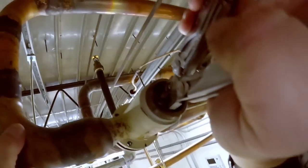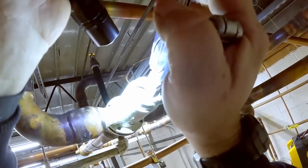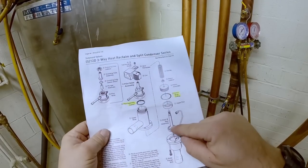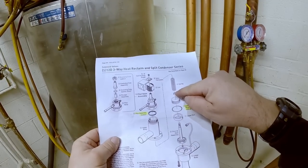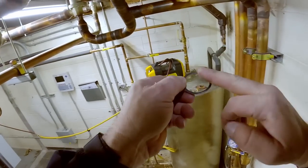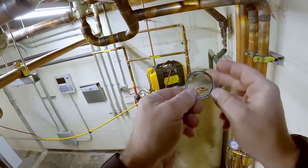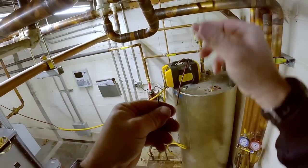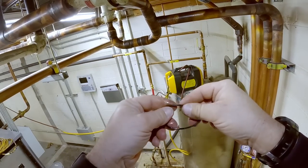There we go — we got onto a nut there. Looks like a stainless steel or aluminum nut, probably stainless. Looks like we can pull this out. That thing I was grabbing was this piece up here — there's that spring, and there's that O-ring. There's enough oil in the body that we can put it right together. Dip a finger in there and let's get the oil on these seals — that will help them squish down evenly.